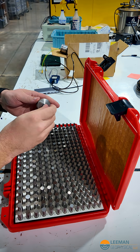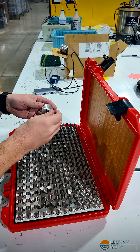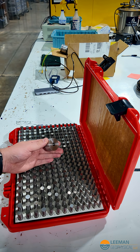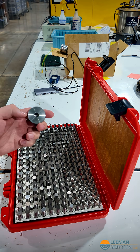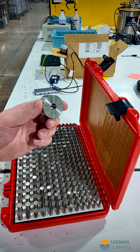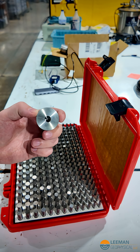That's 397. I can barely get 398 to fit — definitely not 399. 398 fits; it goes all the way to the bottom of the hole. I didn't think we could quite get it all the way to the bottom, but it did. So that bore is going to be between 0.398 and 0.399 inches. That's the best resolution we can get from this set of gauge pins, so we're going to call it 0.398.